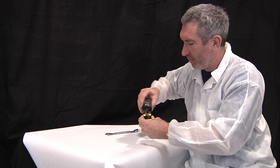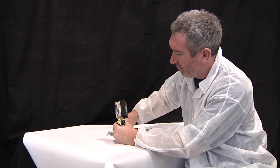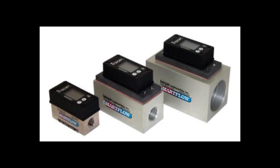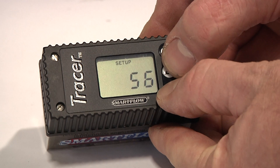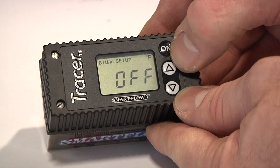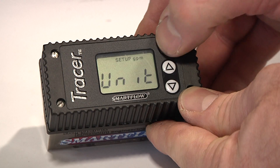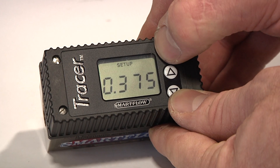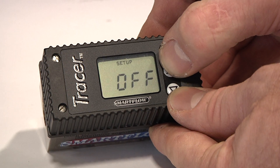Combine Delta-Q with Tracer for the ultimate in cooling function control and monitoring. The SmartFlow Tracer electronic flow meter, now in its 14th year of production, provides precision electronic measurement of flow and temperature. Built around a powerful microprocessor, Tracer offers a host of advanced features and functions, including battery power or remote power, easy-to-read digital display, automatic BTU calculations, selectable English or metric units, programmable alarms, analog outputs for automated process monitoring and recording, selectable corrections for glycol water solutions, and patented FCI technology to directly indicate when flow is turbulent.